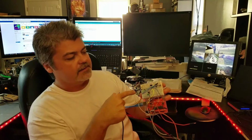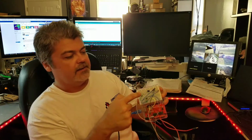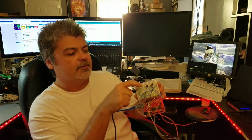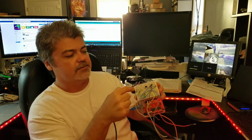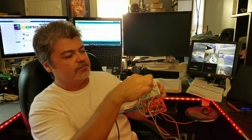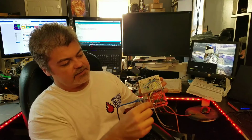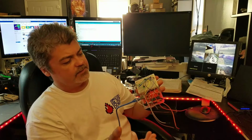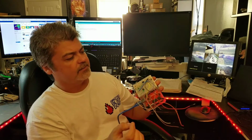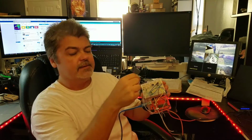And then this is what we used to prototype it with, this breadboard. I don't know if you can see it very well on the camera, but you have an IR emitter, which is this guy, the clear, and then this black one is the receiver. There's 2 resistors sitting between, and one of these is an analog output, which we actually did wire up, but we're not really using at this point. But anyway, anything that falls in between here gets picked up.